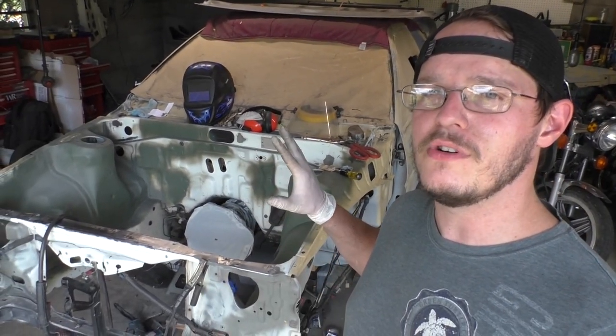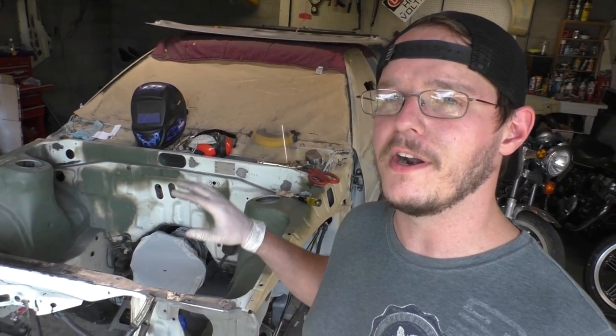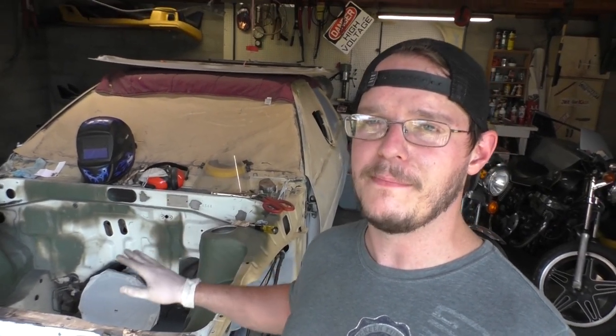So all those little pinholes need to be filled up with a little bit of fiberglass filler, and that'll be our initial filler that makes everything as flat as possible. Then we'll sand all that stuff down, get it all nice and smooth, and then we will coat the whole thing in epoxy primer. After we have it all in epoxy primer, that's when we're gonna get going into the regular bodywork, where I use some lightweight filler and then finalize and finish up everything.